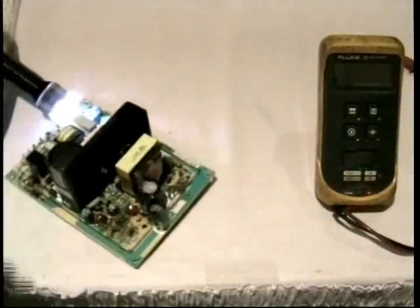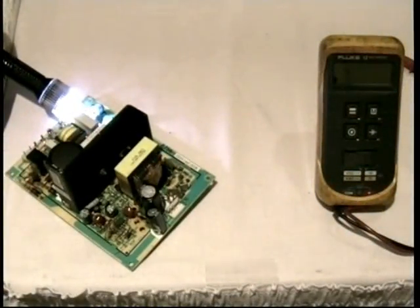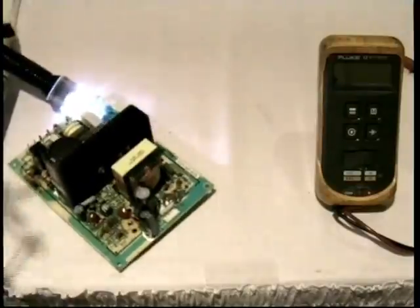This one's quite large, actually, in comparison to most of them. And in fact, let me just pull off this dynamic focus board here. There's a little board here on the Cortec. This little board right here, it's called the dynamic focus board. It does have a nasty problem. Before I forget, this has nothing to do with vertical. It does have a really nasty problem. There's a diode on here that fails all the time. It causes you to have black jail bars on the left-hand side of the screen, typically.